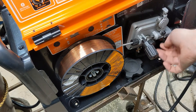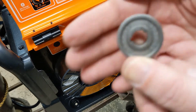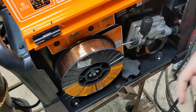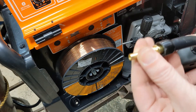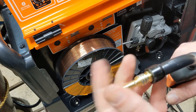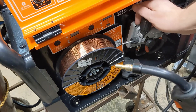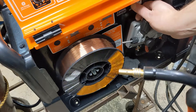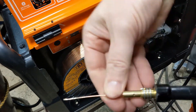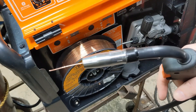We have to flip this drive wheel around. So it was at 025 — we'll flip it over to the 030/035. Take this holder and put it in here. Again, it's reverse threaded. Cold feed it. Put on a new tip, then the new cup. Now we just need to test it and make sure it works.